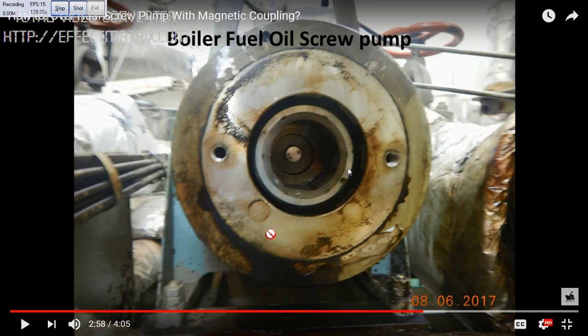If you see the other side, this is the motor side. The motor is fixed and you have the magnetic coupling on this side — the other part of the magnetic coupling. When taking it out, it will be a little bit difficult because both magnets will be holding it, so you have to pull it straight horizontally to take the pump out. There are two screws here — it is a very interesting design.